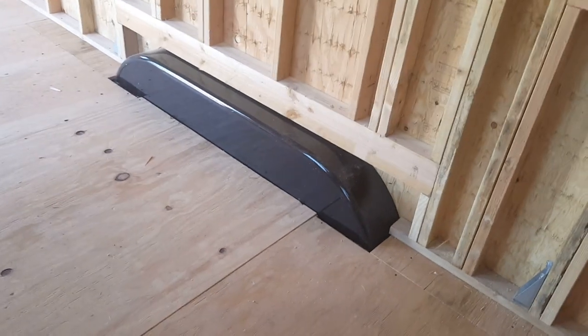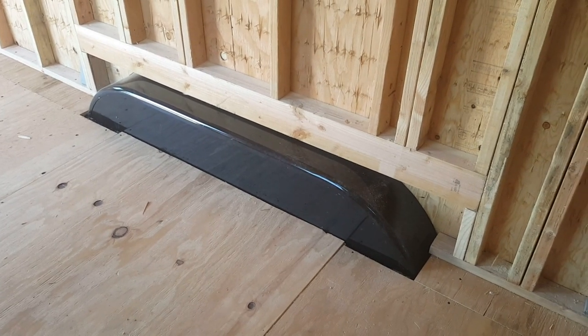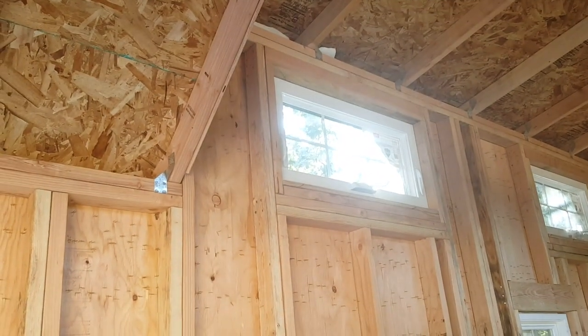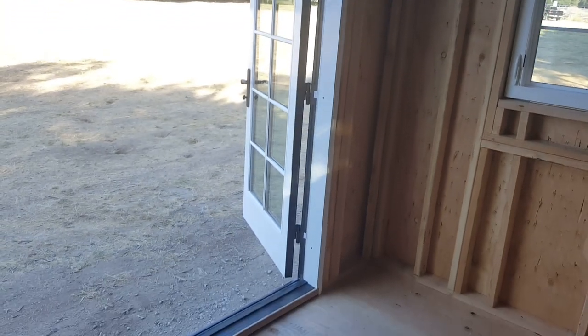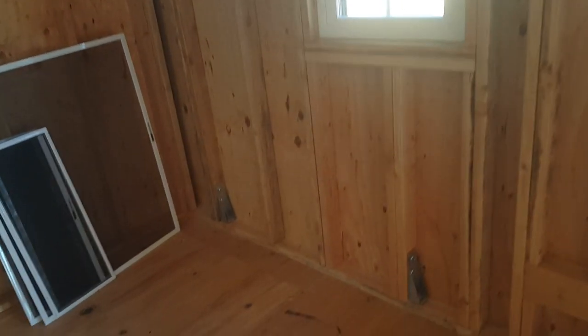All of the fenders are completely enclosed with steel fenders around the wheels. We always recommend, whether you're doing a self build or having us build, to run a header across the fender and treat it just like a window opening — that way the load-bearing structure of the roof comes down onto the header, just like you would frame a window. You can see that on these other windows and also the larger span across the French doors. With French doors — these ones are six feet wide — you can do five feet, seven feet, and you can even place them behind the wheel wells, though the limited space back there for a French door is about five feet. Here's a closer view of our Simpson HTT strong ties on the king stud running all the way up to the top.